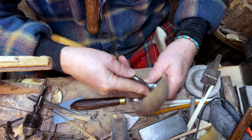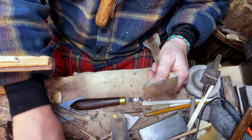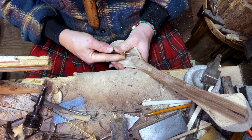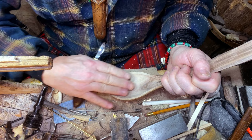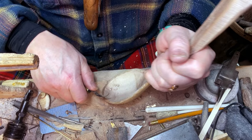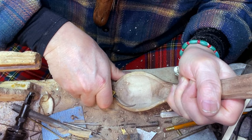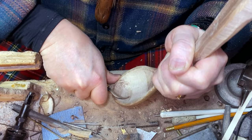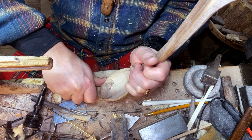The spoon gouge has similar action and works okay, but it works better if I had the spoon clamped down and both hands on the chisel. Really, the hook would be my weapon of choice. This bowl goes down to a certain point, the grain slopes this way, and then you have to come from this direction to avoid digging underneath the grain and causing a splinter or chip. Cutting across grain like I'm doing mostly here is how you get the best control. But if you really want the smoothest cut, you angle your blade as you're going across — it's like a skew, it slices more.